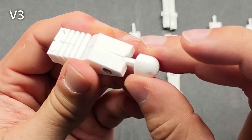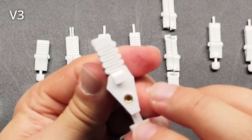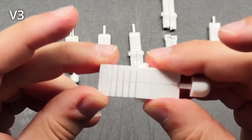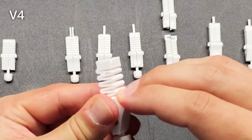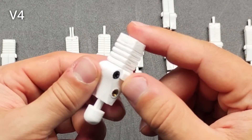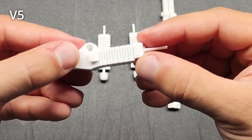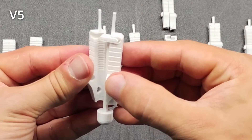I reverted the spring gap increase, and it turned out well, but when attached to the leg, the two sides would split apart, which in hindsight makes sense since there was nothing holding them together. I added some holes for an insert and screw, which fixed that issue, but the spring was still way too strong. I also still had no way for this mechanism to actually press the switch.